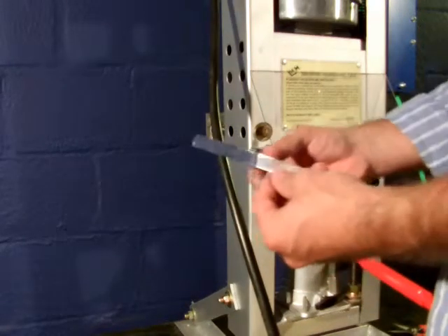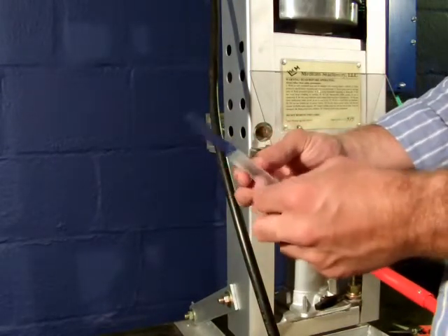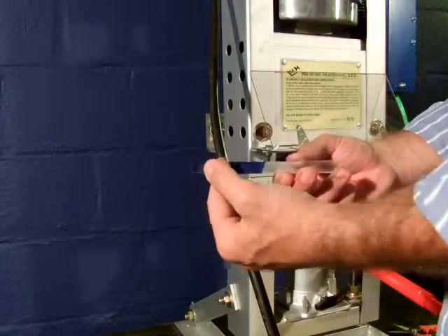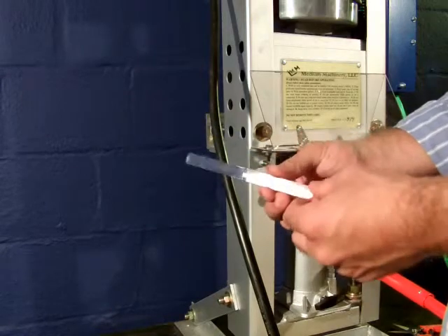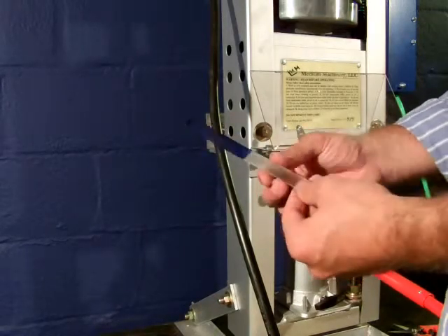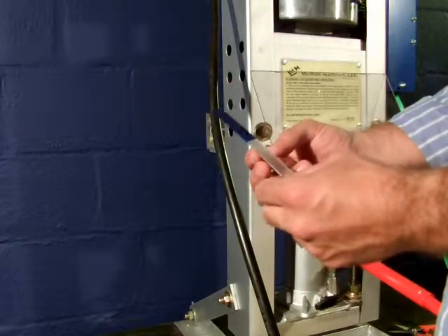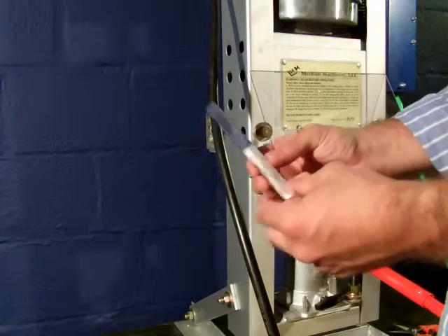This video is about injecting a test piece, in this case out of clear plastic — styrene in particular — to perform a paint test. Basically, half of the part is painted and the other part is kept clear as a control to dip into various chemical solutions and see how well paint adheres to plastic. This kind of test can also be made for an ASTM specimen or any other mechanical fatigue test.